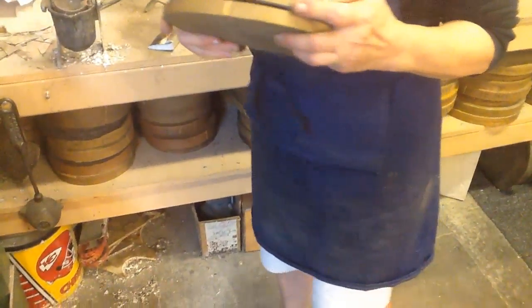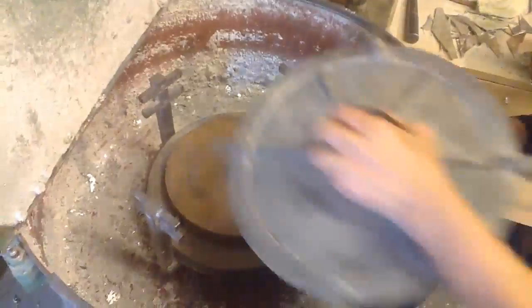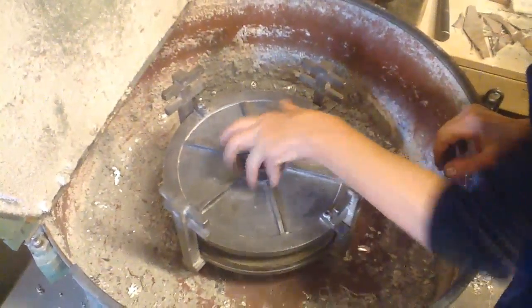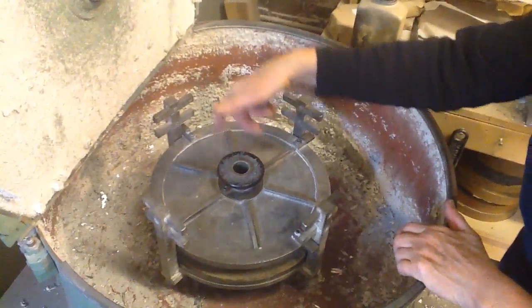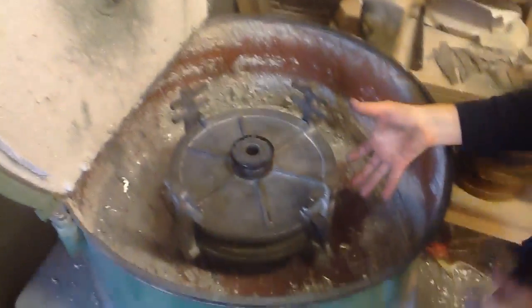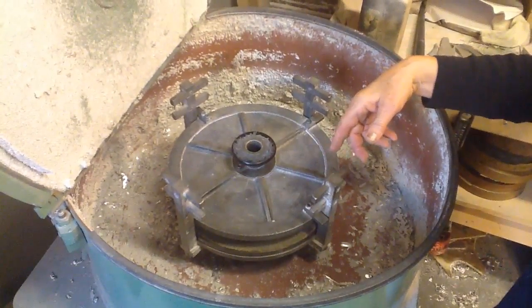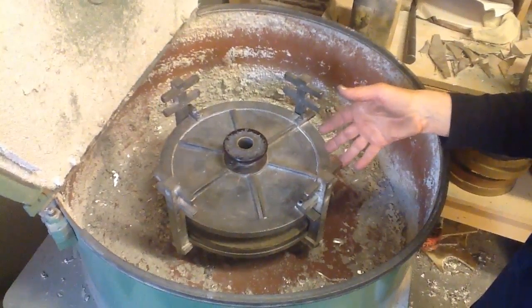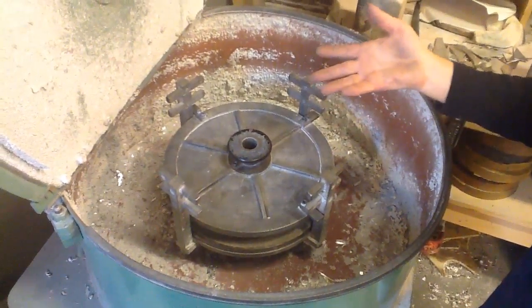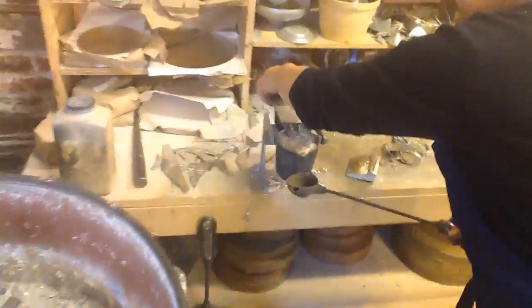So I take my mold, put it within my casting machine, and place that on top. There's a center entry and that's where the pewter will enter. When I close the lid, air pressure in the line will clamp the mold together. It will automatically begin to rotate and it takes only 30 seconds to go from liquid to solid, then I'll open it and release my castings. So this is my molten pewter.